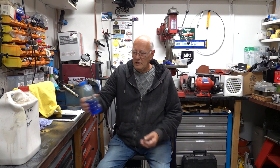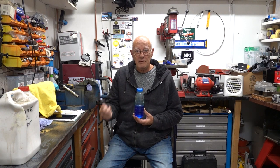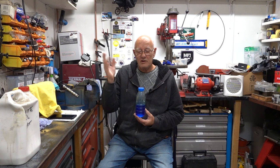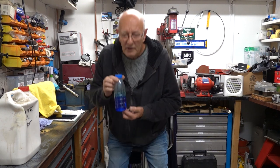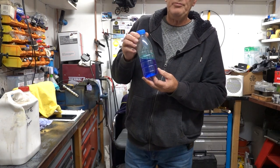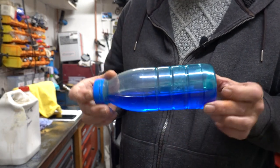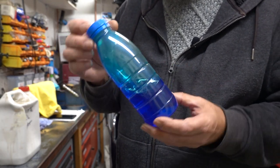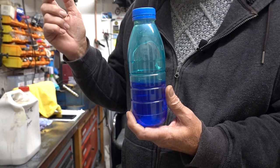You'll see me talking about PVA in it, and I'll just show you. When you talk about PVA, you think about wood glue, the white stuff you mix with water, thin it down, and you can put it on before you plaster a wall, it bonds to brickwork, and so on. This is not the same stuff. This is PVA, it's a release agent. And you can see that, it's just like blue water. You put that in your spray gun, you don't thin it, you put it in as it is, and you spray your panels that you've done.